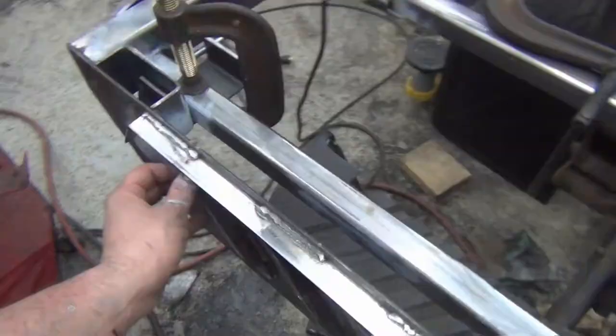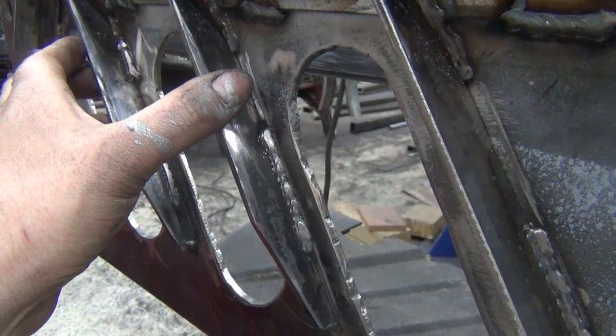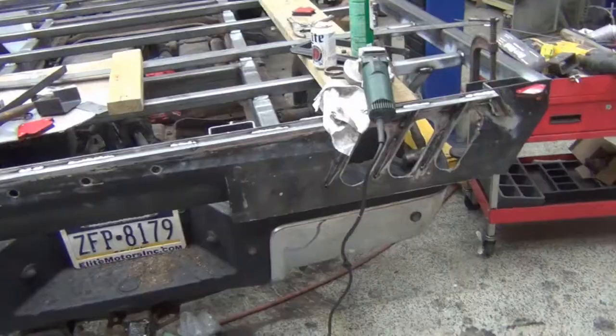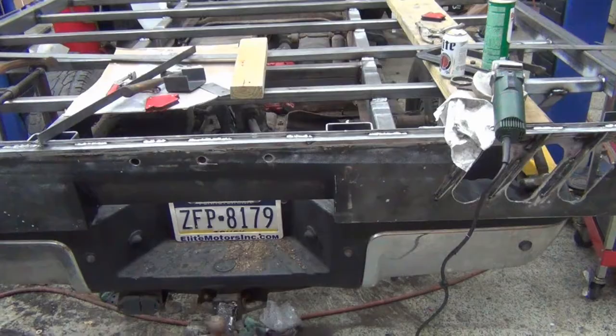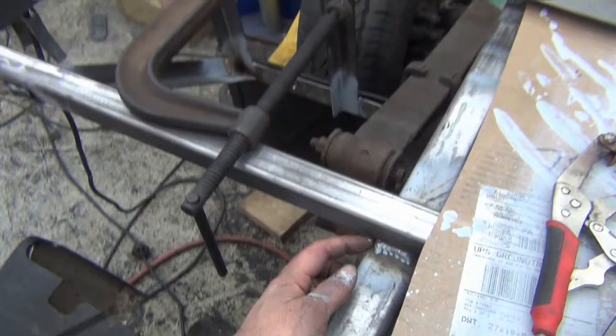These are 8-inch pieces, and then I cut them so that they were slotted and they fit up in there, stuck them all together, and put this angle on here. And then I stuck them at a 30 degree angle. That'll protect the lights. So if I run it for this panel, other than those light protectors, we'll come back when the rub rail is done and it's all tacked in. I could finish welding all these other welds, weld around here, and get that all done.